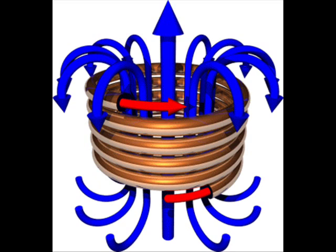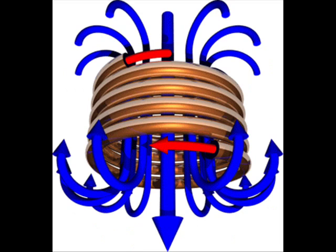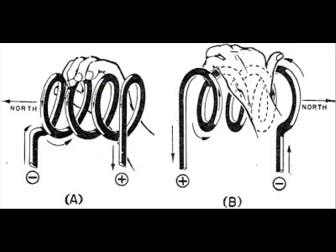See, the arrow pointing upwards in the coil is the strongest magnetic field line. The other lines wrapping around the coil do not have any significant forces. This main magnetic field line would point downwards if the current was reversed. Depending on the direction of the current, the force is either up or down. Depending on the direction of the current, the electromagnet acts as either a south or north pole there.